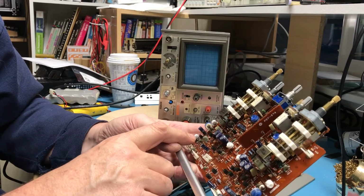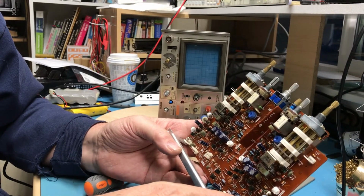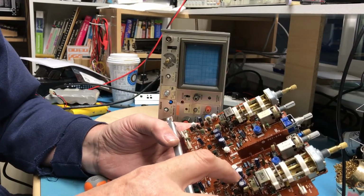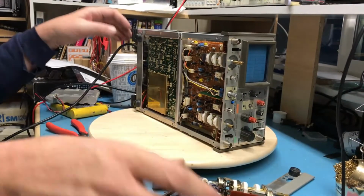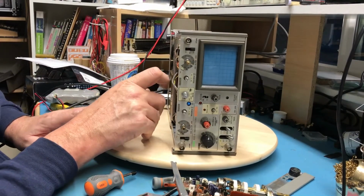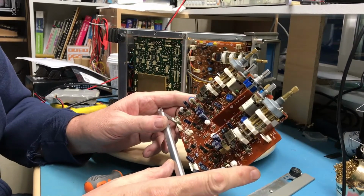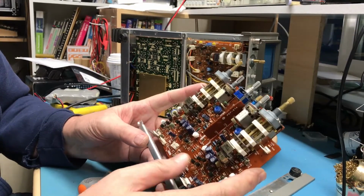That's the same. Because both channels are affected, I tend to, as I just said, think that it's something common. But perhaps it isn't. I don't know if I've got any 100 microfarad, 25 volt caps. I would have to look. Looking in this scope, the caps aren't the same, which makes me think at least 3 of them have probably been replaced over the years. It may be worth digging up a full set of caps for this and just recapping this board, since mechanically the board's in good shape. Like I said, this does definitely isolate this to this front end board being the issue.